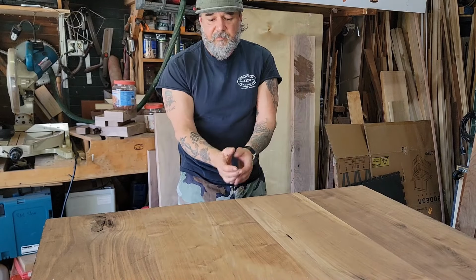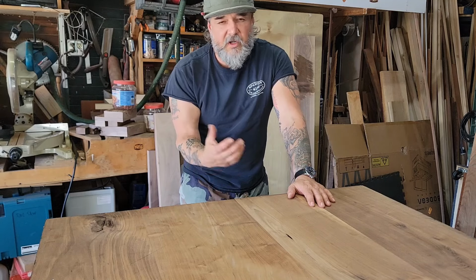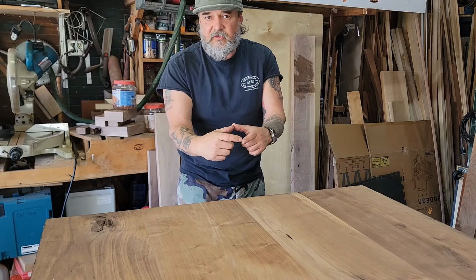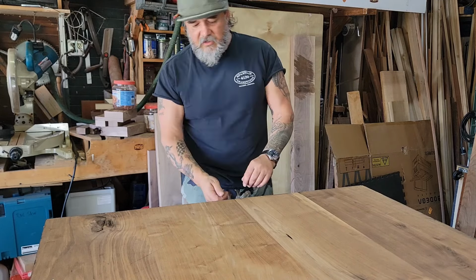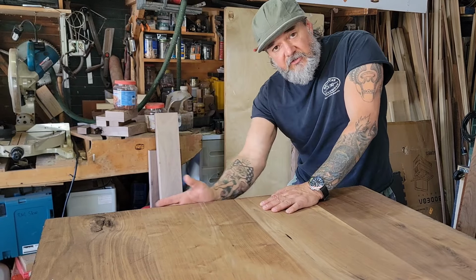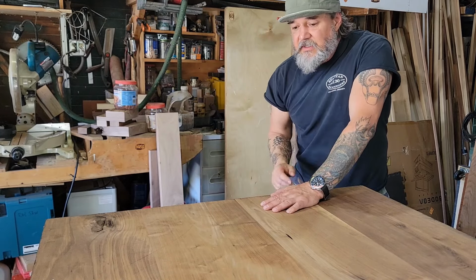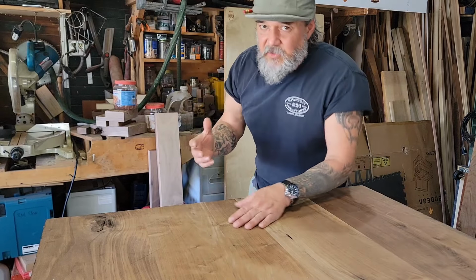You do your glue up, and then you could take a router bit, make a jig, however you want to do it, and put a slot in the end right here. And you can make it pretty deep. You can make it 2 inches deep if you want. Then you cut a nice piece of hardwood, maybe contrasting color, and just tap that in place and then shape it. You can make it flush, or you could shape it with a chisel so it protrudes, but it's chamfered, faceted, you could call that. I've done it all. I've done Charles Rolfe's pieces.